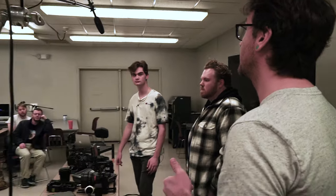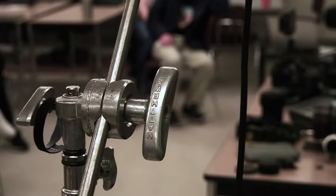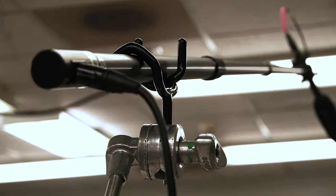The easiest thing to do with these mics, especially if all of the branding is gone, is start with phantom power off, and if you're not getting a signal in, turn phantom power on, and if you're still not getting a signal, turn phantom power back off, because then it's a problem with your mic. If you plug some of these really nice high-end condenser mics, which in the audio kit are like $4,000 or $5,000, in with phantom power, you'll hear a little click pop inside of the mic, and then they're done.